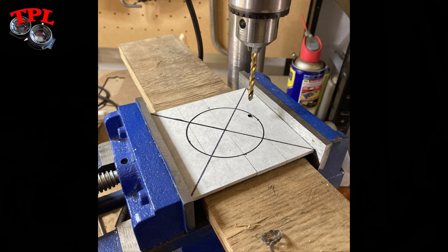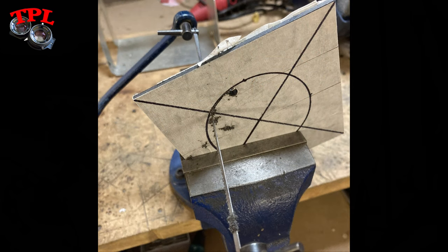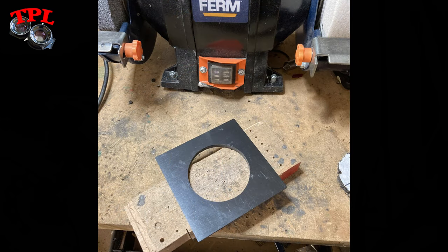Unfortunately, that means bits of the lens will interfere with the front standard of the camera, so you actually have to mount the lens flange on the front of the lens board. This is not a problem because it's got four holes in it. Sawing the nylon wasn't particularly arduous at all — quite exact, but it really didn't take very long, maybe 10 or 15 minutes. With the hole cut, I tidied it up with a Dremel, which wasn't difficult but was somewhat messy.